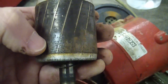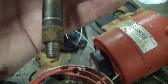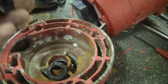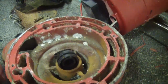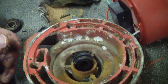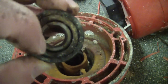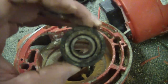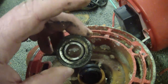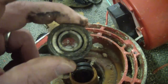We can see the shaft has had some contact with condensation at least. Looking down the rotor, we can see at one point it was sitting in water. And interestingly, in this housing there are not one, not two, but three Buna-N single-lip seals to seal the shaft. Three seals — amazing. That thing will never leak, right? Well, here's the bearing that packed it in. You can see it packed in so bad that it actually wore the shielding right around — the 'Germany' is half gone. Initially I thought this was a Sprag bearing, a one-way bearing, because it would only turn one way. But of course the reason is because it's hooped.